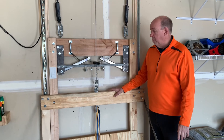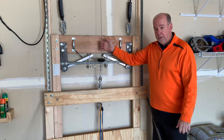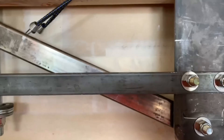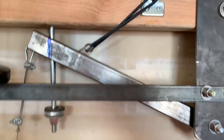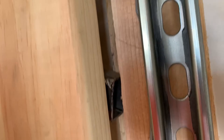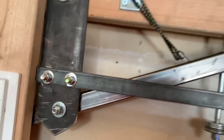So, how is it actuated? Well, we want the brake to engage anytime there's any loss of tension at all in this rope from the hoists. Let's start with the bars. We call these the jamming bars or the jam bars. What we want them to do is to jam into the rails on the sides. We want these bars to come down and jam into the side like that, pivoting on this pivot hole right here — one on this side and one on the other side too, pivoting here and jamming into the side rails.